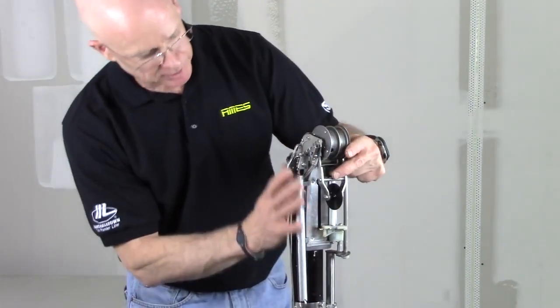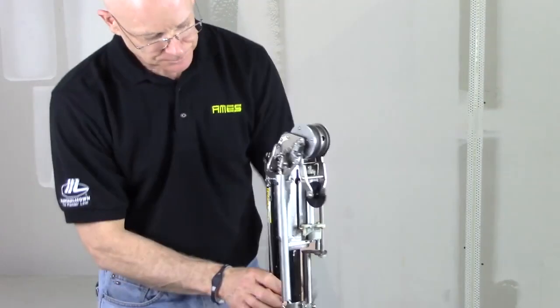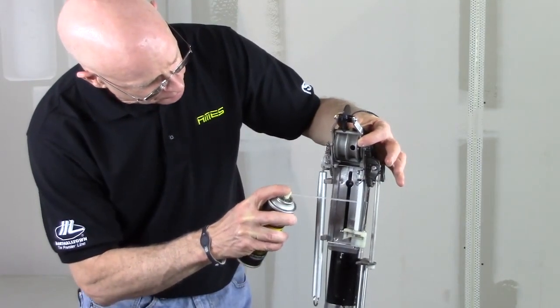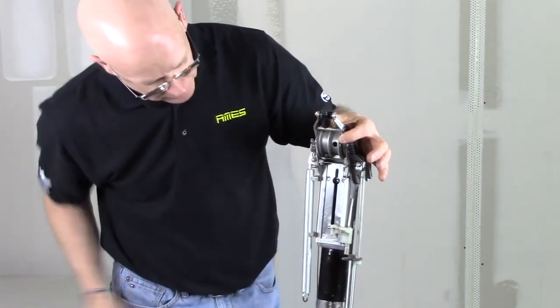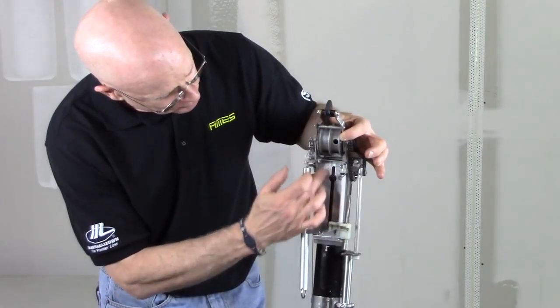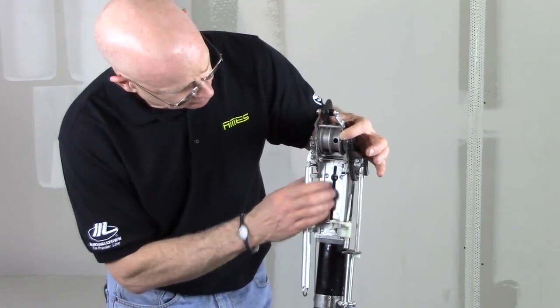Keep that nice and clean — mostly the whole head. You want to keep anything from drying out on the head of the taper. Now for lubrication points: key points you want to keep lubricated — certainly where the tape moves, and definitely right here where the gooser needle moves up and down. It's retracted with a magnet, so we want to make sure it's moving smoothly and freely. There's no dry compound getting up in here, so oil that a little bit and keep that nice clean movement.